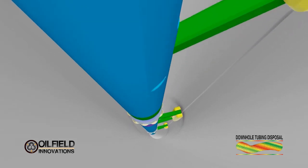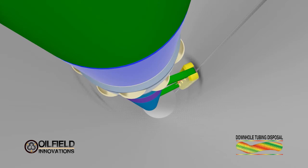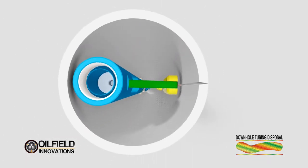Broach roller bearings adjacent to the housings roll along the bottom of the tubing, while the skates roll along and cut the top of the tubing. With regard to any wax or scale buildup on the inside diameter of the tubing, the ball bearing broach arrangement point-loads the rolling and lifts the tool string slightly above the bottom-side inside diameter to lift it above modest wax and scale buildup. For heavier wax and scale buildup, you can use larger-diameter go-devil wheels to lift the tool string higher.